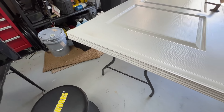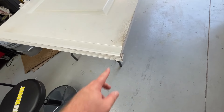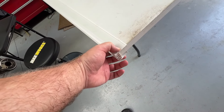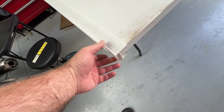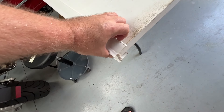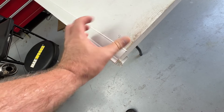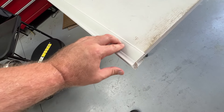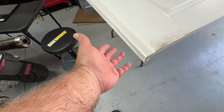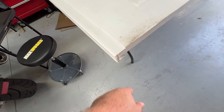No more gap, no more bugs. Super easy. If you do end up needing more contact space, you just slide this down. It's just a compression fit — it's not fastened on, it's not going anywhere. But you can just use a screwdriver and tap this down. It's still a little flexible so it's grabbing on there real good and solid. You can lower the whole thing wherever you need to fill any gaps. Maybe your threshold has some damage — you can take care of it that way.